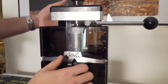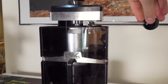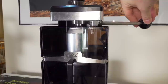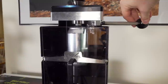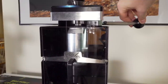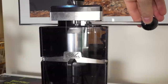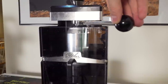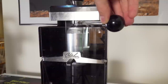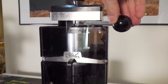The first step is to make sure your can seamer's operating arm is in the zero position, meaning neither of the rollers will engage the can when you set it in. Set your can, lock it in place, get your drill spun up, then slowly push forward on the lever until it moves to the one position — where the back roller engages the can. Once that roller starts making contact, you'll feel some pressure. Keep slowly increasing pressure until you hit the mechanical stop at the very back of that range of motion — you'll feel the can finish the first part of the seaming process. Then slowly pull the lever back towards yourself to the two position, where the second roller makes contact. Again, feel the pressure as the can seams fully, keep pulling until you hit that mechanical stop, hold it for a couple seconds, then return to zero — your can should be fully seamed.